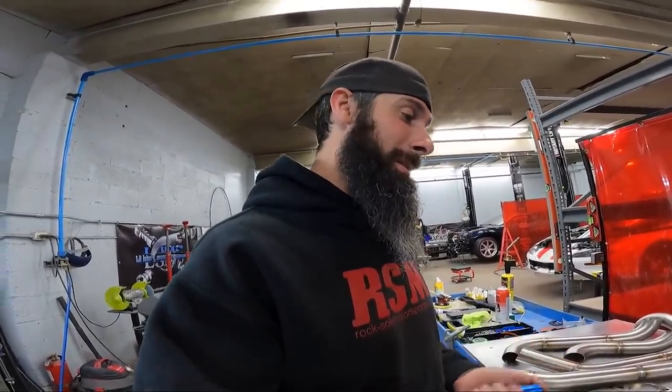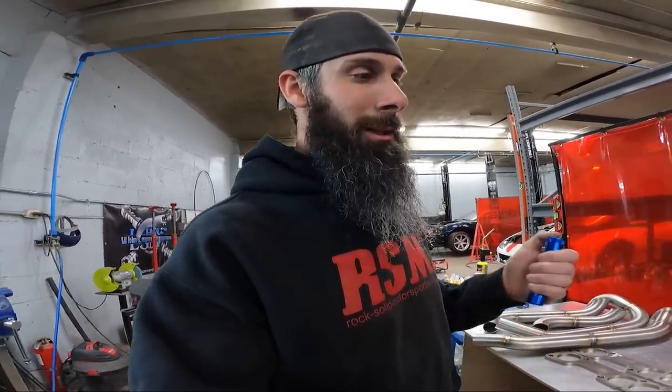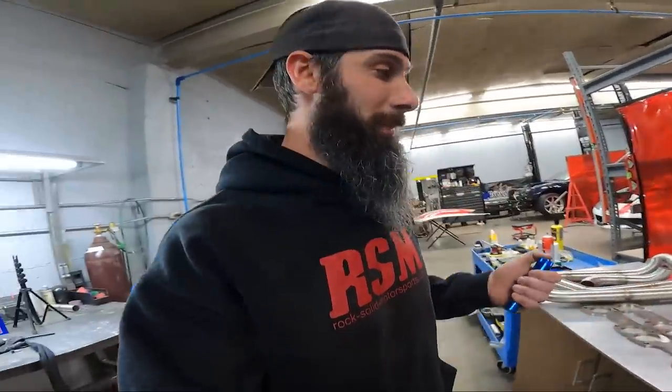But you know, sometimes you get in a rhythm and you get to doing something, and sometimes you might rush it and not even realize it. So for what ones I can see up in the end, every time I'm done with a primary, I'll look up in the end and make sure I'm still staying consistent with my welds.